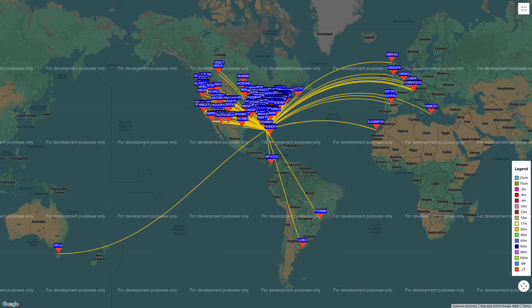Let's take a look at a couple of whisper maps because I want to explain directionality, then I'll show you what I can do on FT8. Here's a 12-hour whisper map on 20 meters. I started it late in the day — around 7 o'clock in the evening — and ran it until about 7 or 8 the next morning. Whisper is an indicator mode; from my perspective it's something I can use to compare two antennas side by side. In this case I was really looking for directionality, since this looks like a dipole with a left side and right side radiator, and dipoles can be directional broadside to the element.